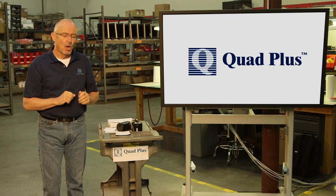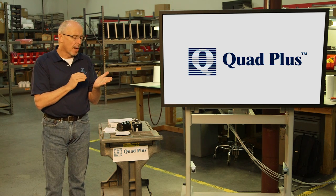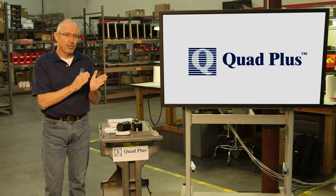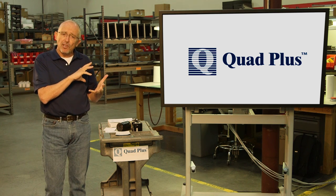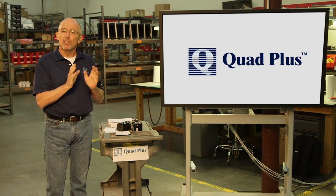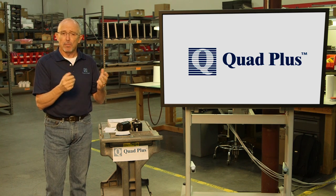Here's the problem. Over time, that oxide layer will become uneven — it degrades over time. If you apply full voltage to the capacitor all at once, you may have an area where it's been depleted, and you'll actually punch through because the capacitor just can't support blocking that level of voltage. For a capacitor that's in service, there's a chemical process that happens within the cap where it's continually replenishing that oxide layer. When it's on the shelf is where the problems start.